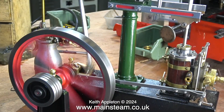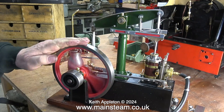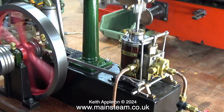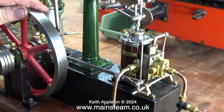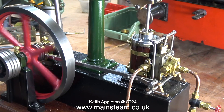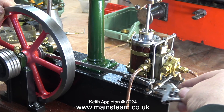Time now to let in some compressed air. And that's really not bad — it still needs a bit of tweaking to get the timing to perfection, which, don't forget, is just before top and bottom dead centre. The timing is nearly right, I just need to do this one final minute tweak to the position of the slide valve linkage. Why do I use a hammer? Well, because I do. The tap with the hammer just aligns everything, and now I can finally tighten up the linkages.